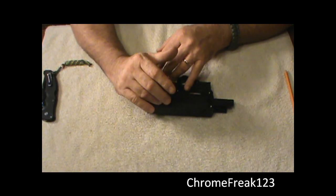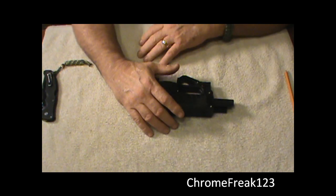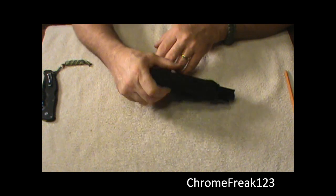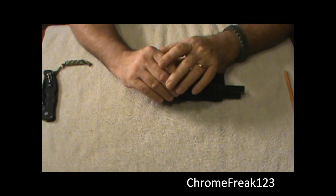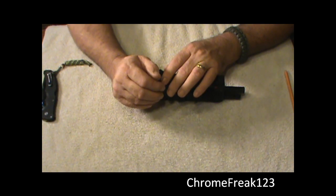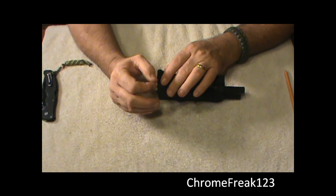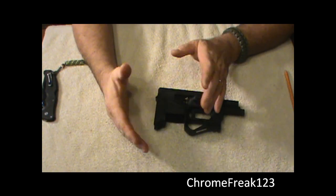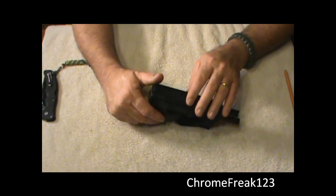We have sold a few from the shop, and this is the only one that has come back so far. I know there's been issues with this gun — maybe it was rushed out a little too quickly. As a gunsmith armorer, one of the problems I see is no extractor. In a blowback design I can see it working with good ammo, but I think they should have fluted the inside of the chamber, kind of like a CETME battle rifle or G3 — they have a fluted chamber to aid in extraction. Maybe that's a fix for it. I'm not an engineer, but maybe that's something the people at ZIP could look at.